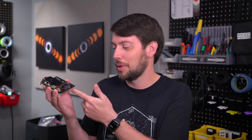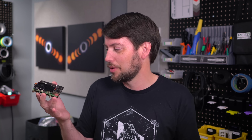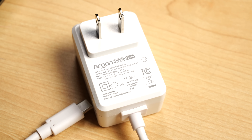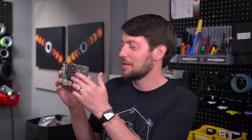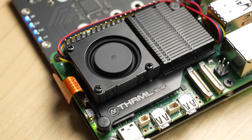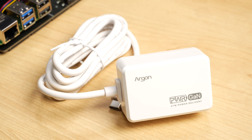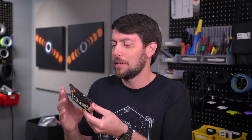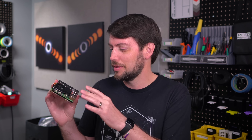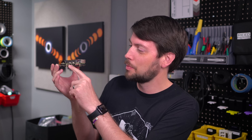The ugly thing on this board is the power circuitry. It has a DC 5-volt barrel plug jack, and the Pi also has a USB-C power input. Their wiki says don't use both at the same time. My guess is there are no real back-feed protections — I'm not going to test it because I don't want to sacrifice a $60 Pi 5. I don't even have a 5-volt barrel plug power supply; they're not that common. I'd recommend powering it through the USB-C input instead.